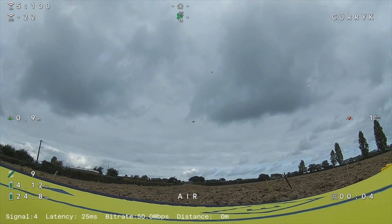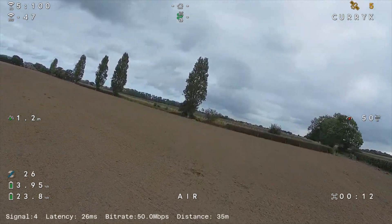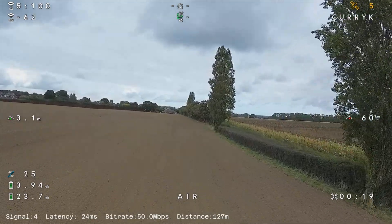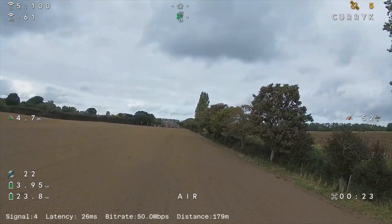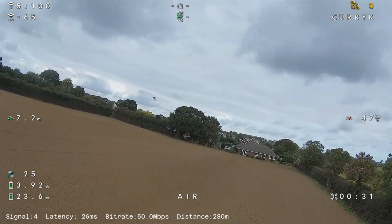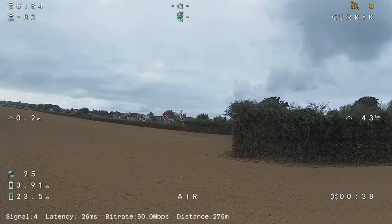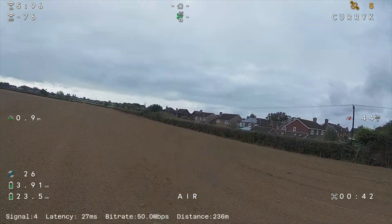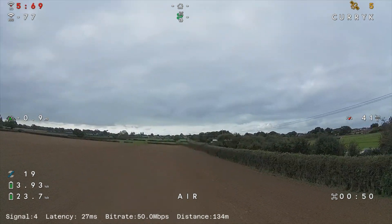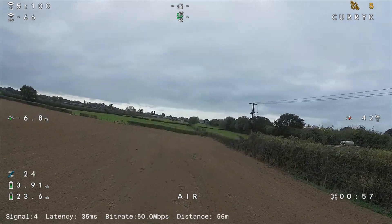I'm going to speed this up in a second but I'll talk you through the first part. First off, I had this thing sat on the ground for a good five to ten minutes and I couldn't seem to get more than five satellites. I thought, I don't care about having rescue mode - I'm just going to fly around this field. I'm quite in control of where the quad might go down, and we're only talking something like 300 meters away at the very longest. However, there were portions where you see the LQ really dip. I think it's a combination of these nearby houses and the antenna getting blocked. We got down to an LQ of 32, which is pretty bad, so at some point I started flying a bit higher to help that out.